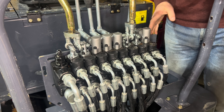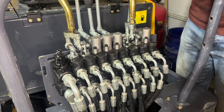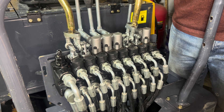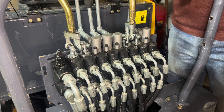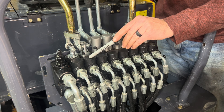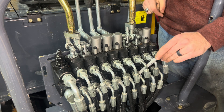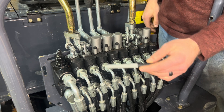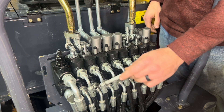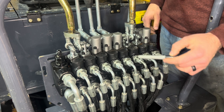Now that we've got our cover off — and the bolts are probably going to be loose anyway if you know anything about these machines — we can see our control linkage for our two levers. We are interested in the forward and back change; we're not changing anything side to side. I've identified the directional control valve on each side, wrote a one on the upper and lower hose on one side, and a two on the other side. When we're done, we're just going to do a one-for-one switch to the other side without changing the order of any hoses, because the flow of the hydraulics through the lines does not change.